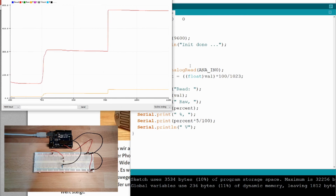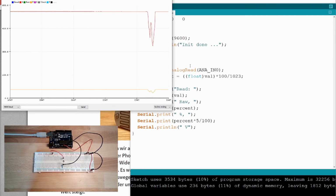It's not a big thing, right? I mean, it's just a voltage divider like we've used in our introduction to analog inputs. When you remember, your task with analog inputs was that you should turn the brightness of an LED up and down. You can now use exactly the same program you programmed there, with the LED. And then if the ambient light is dark, the LED will get dimmed, and if the measured brightness is high, the LED will get brighter.